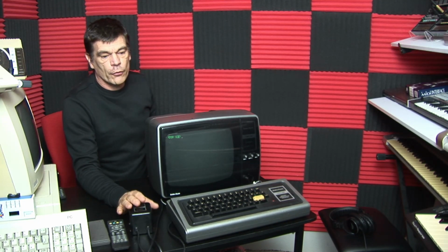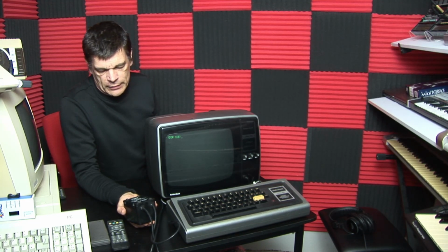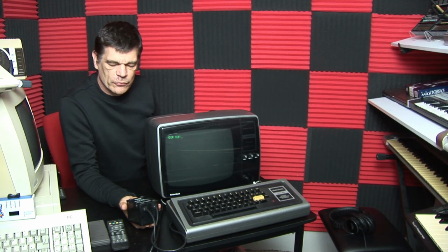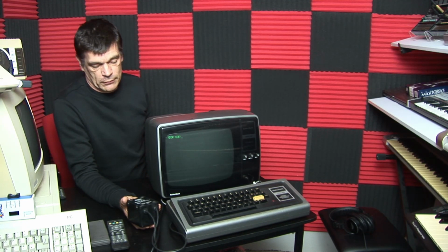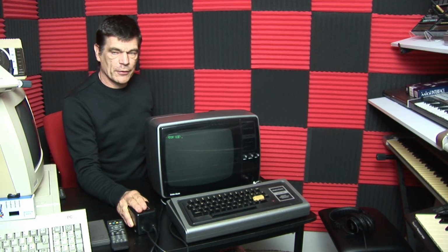Power supplies are quite bizarre, because you've got a single power supply and it runs both things. I always thought that was a little bit dangerous. It's a Tandy power supply, and what it seems to have been is something they already had in their catalogue of parts, because remember, Tandy and Radio Shack were an electronics and electrical retailer. So it's a 240 volt UK spec, 50 hertz, 17.6 volts DC power supply at 350 milliamp.